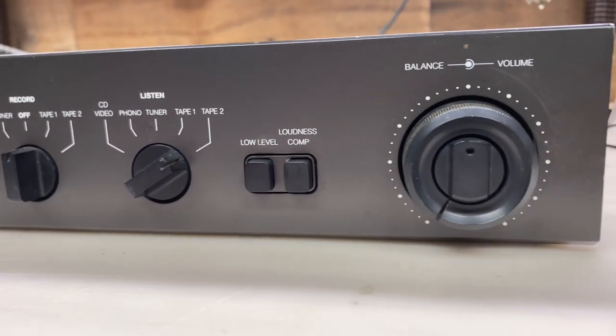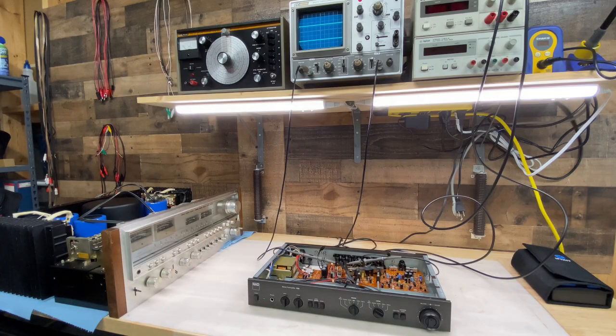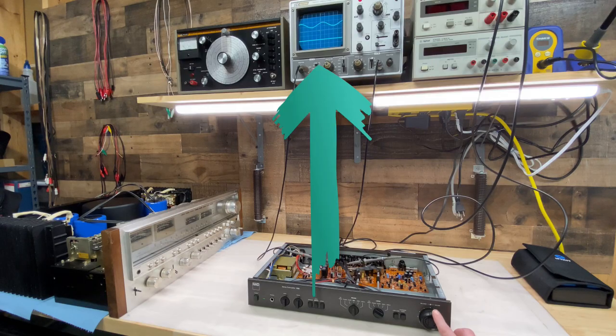The complaint from this one is that we get no output no matter what input is used, and I actually was not able to reproduce the problem until recently. I have a one kilohertz sine wave at the input of each channel, and you can see we do get an output but only from one channel. I believe I've actually already figured out the problem.